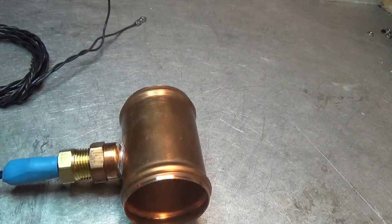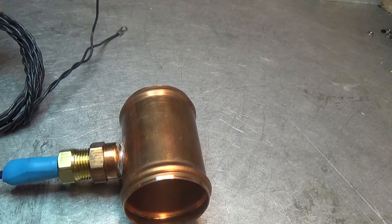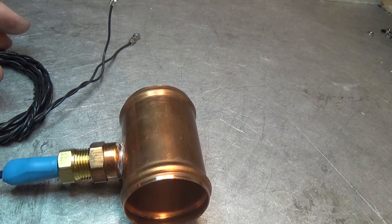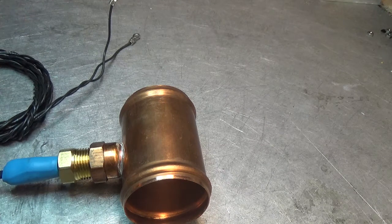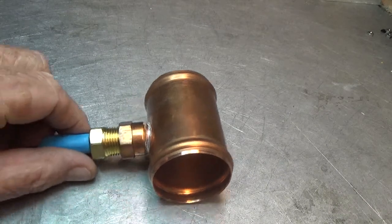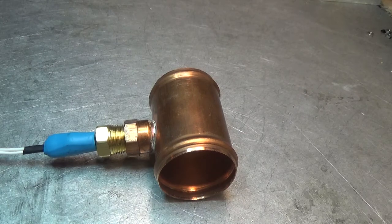It can't control properly if it's on the inflow of the radiator. All these sensors have the same resistance — 40,000, 50,000, or 60,000 ohms when cold. Let me know if you have any trouble or questions; give me a call or email. Thanks, guys.